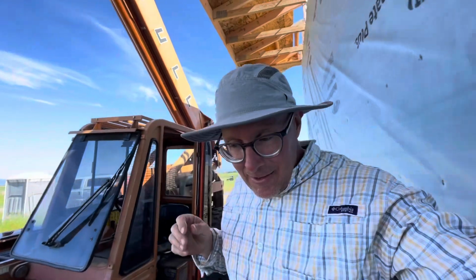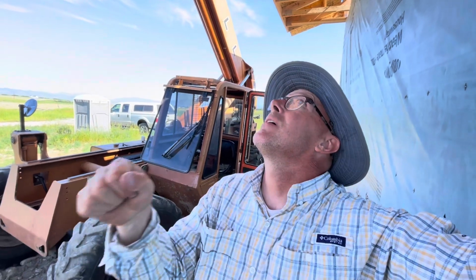I'm running the truck, so I can't really. I'm trying to watch Greg and the little nuances he does as he goes. And the first row, I mean, they were just falling evenly on center because we had marked every 2 feet and it was just set. But the second row, I've noticed he's having to push and pull. He had to clip a couple of those metal folding braces just because they had a little too much hold on the truss, and he needed to push and pull them slightly. And just as he goes on that second row, he's trying to make sure they're all centered on 2 feet. And he said it should start flowing sweet from there, but sometimes those trusses have a little bit of wiggle to them or whatever. It's nothing bad. He's just taking care to make sure that everything falls on seams at the 2 foot. And sometimes he has to push and pull a little on those trusses that are sitting loose like that.